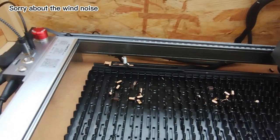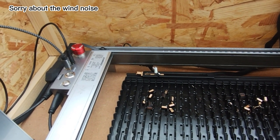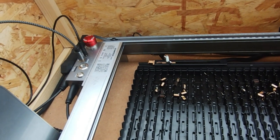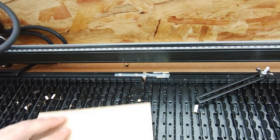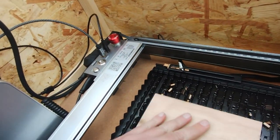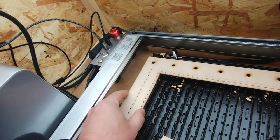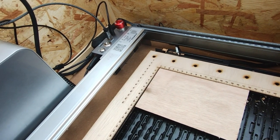So what you need to do is to make some legs for it. Why do you have to make some legs for it? They should be supplied to raise the frame of the laser up in order to create space for the gantries to run. That's the biggest problem. This edge is flush. There's no lip around it. There's nothing for you to push your edge up against, which is even worse in the corner. So you've got nowhere to index your material into. That's why I'm going to try and find a way of attaching a ruler guide in the corner so that I can locate some material.